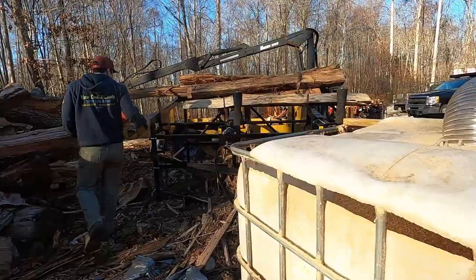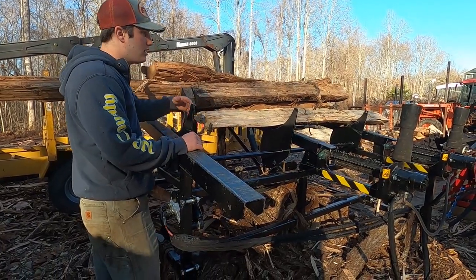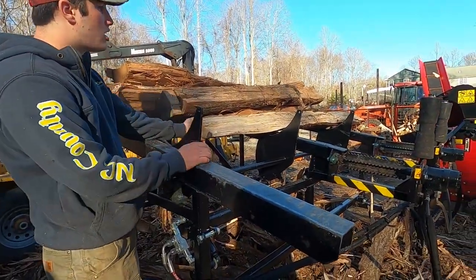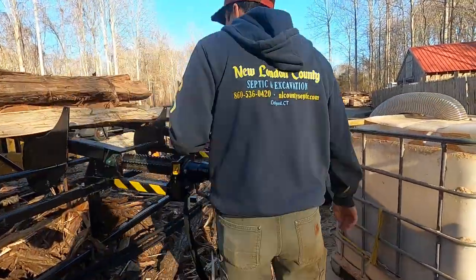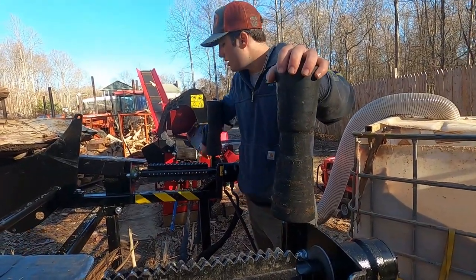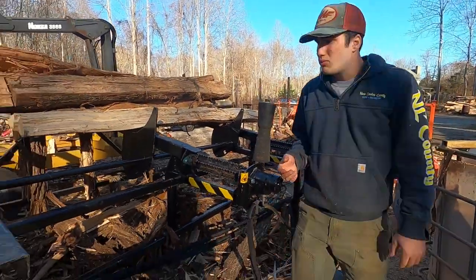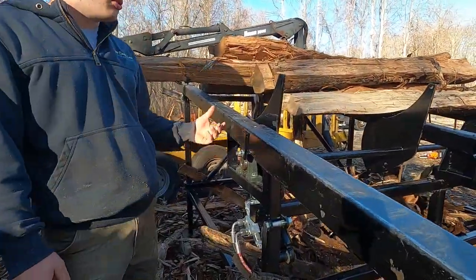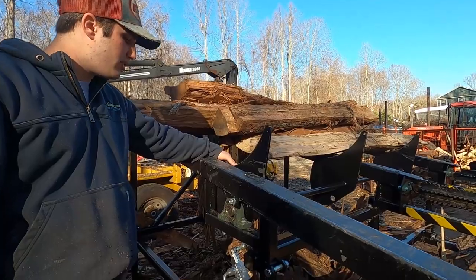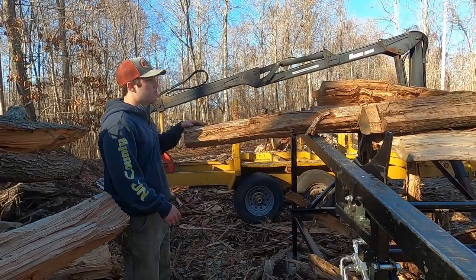On the gravity deck it's got this triple-beam setup. When I take the lever and push it forward, this piston pushes down and the logs roll onto the rollers, which are powered by the infeed conveyor — however fast the conveyor is going, those rollers go at the same speed. I did have one problem with a pillow block bearing; I think I rolled two logs on it when I first got it and it exploded. I called Metz's and they sent me a new one in two days — super easy to change out.